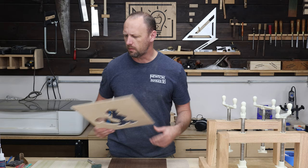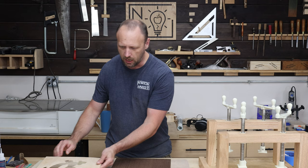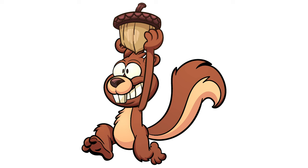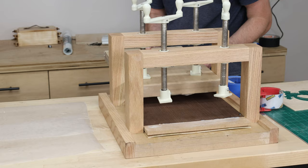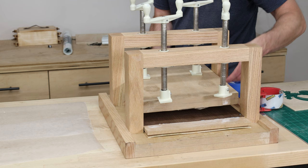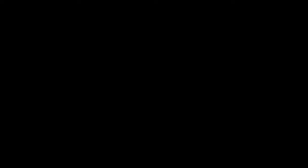The silhouette doesn't look too bad. Now it's time for a kind of complicated glue up. I've got the silhouette, my poplar panel, and a piece of wenge veneer — this is what's going to give the artwork a dark background. I'm going to glue this up in two stages: put the poplar on one side, the wenge on the other, stick it in my veneer press for maybe half an hour. Then crank open the veneer press, glue the silhouette on top of the wenge, crank it back down, let it sit overnight. Come back and start putting all the pieces together to make our angry squirrel.